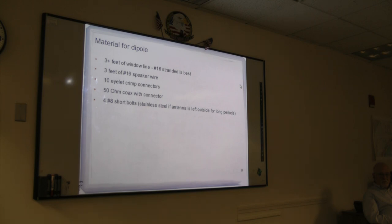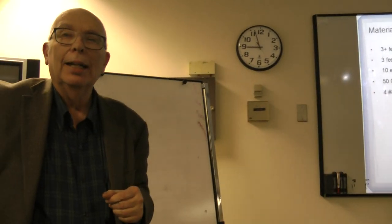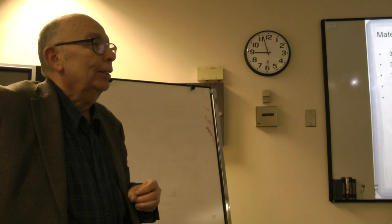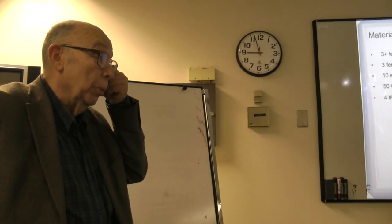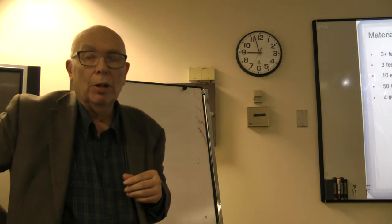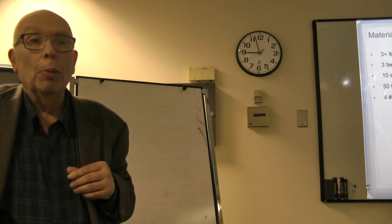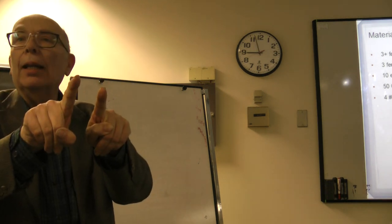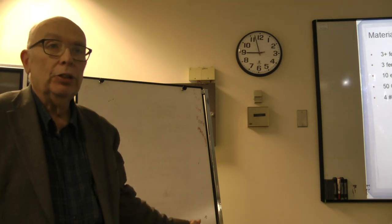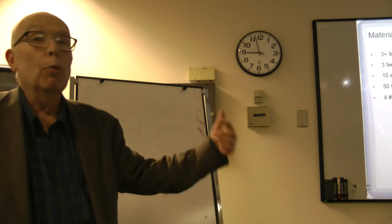It can go any way. There is a very good program written by somebody with the call K1FC that's actually on their website. It's a very technical program, but not too many people figure out how to use it. But if you do, you find it's an extremely powerful program called SWRplot. If you know the impedance at the antenna, and you know the characteristics and length of the feed line, it'll tell you what you've got at the other end of the feed line. And it works both ways.